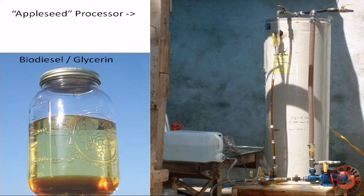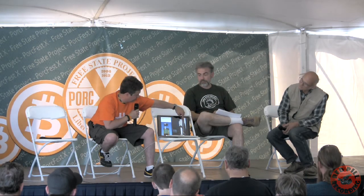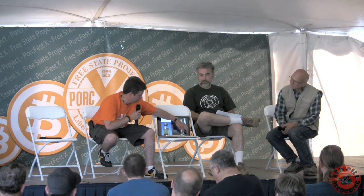You then throw the ball valves and it's just going to recirculate it. Pull it from the bottom, bring it up on this final hose and drop it in at the top. When you're done mixing your chemicals and you're ready to add that, once it hits 120 degrees, that's what this container is. You throw a different ball valve, it's going to suck that methoxide and bring it in there and start the reaction.